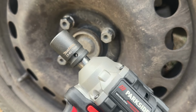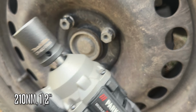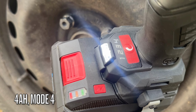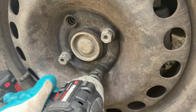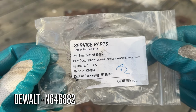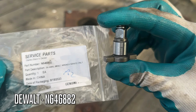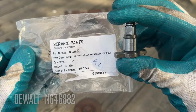Half inch anvil and same Makita socket, albeit in a half inch form. 210 newton meters, which the 3/8 anvil couldn't undo. Full battery and mode 4. So this is the 3/8 anvil that I used in the video. I'll leave all the info that you need, as well as a link to where I bought it from, down in the description.